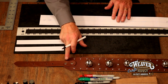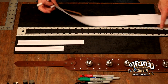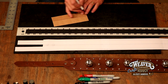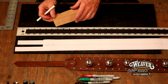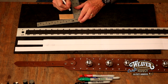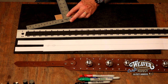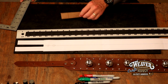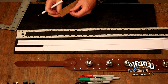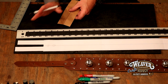Now we need an English point, but I don't have a two and a half inch wide English point, so let's make a pattern for that. I'm going to take a piece of heavier paper — I'll be able to use this time and again. Two and a half inches wide, got my center line. I scored it with several passes so it makes an easy bend. If I came down two and a half inches, that's going to be one seriously deep point — I don't want that. Let's cut that in half and come down one and a quarter inch. I'm going to cut from my fold out; cutting from the opposite side makes a big V, which is not what I'm looking for. Let's just cut a nice even curve with my knife.